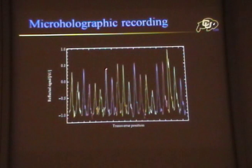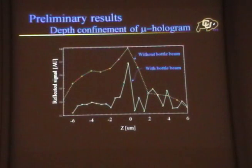Again, this is really typical of these materials at the micron scale, as you can see some variations in sensitivity. That's often the case of getting your mixing really, really good, because you're getting down to the point you're probing them on a fairly fine scale. And if all your initiators and other chemicals aren't really homogeneous, you see this sort of slow variation of the sensitivity on the 20-30 micron scale. But this is the good thing. This is somewhat preliminary, as in 3 weeks old.